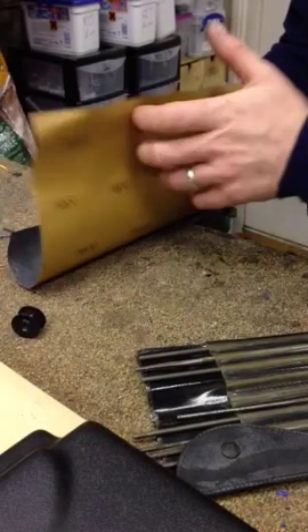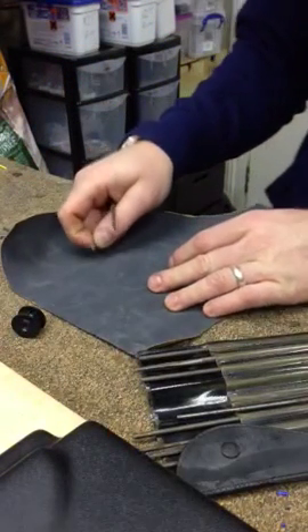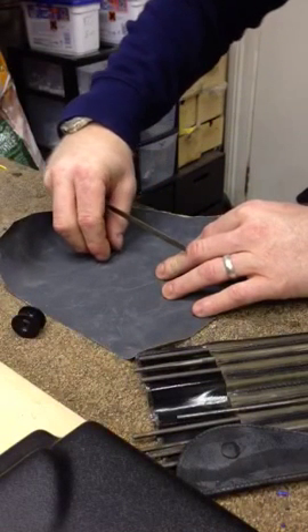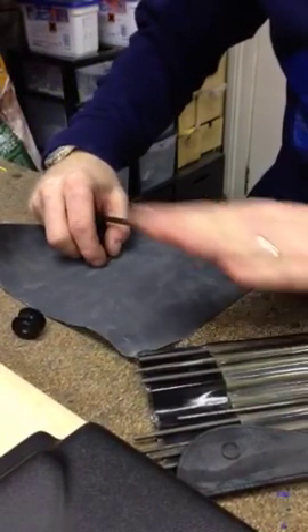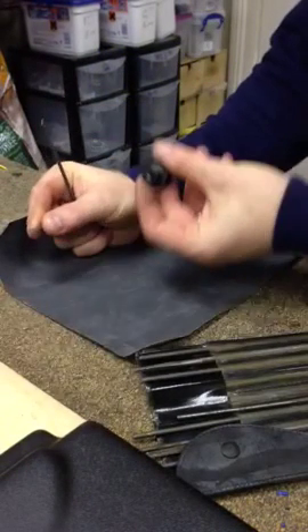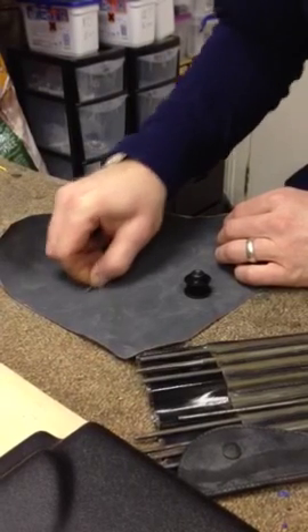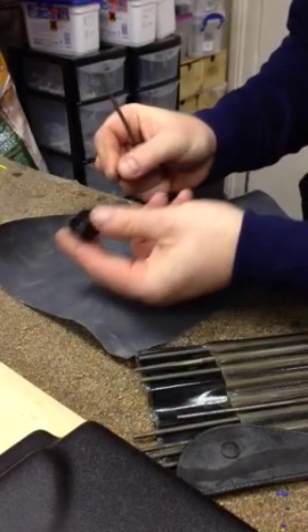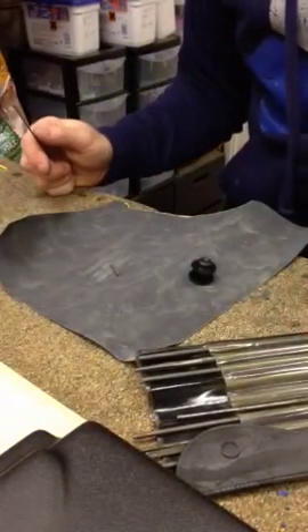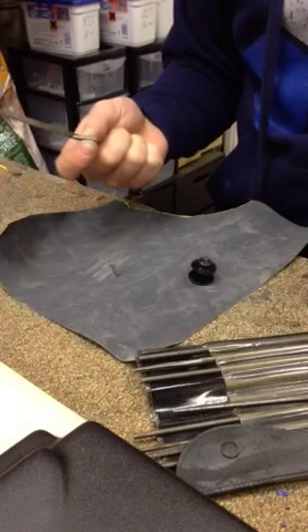You want something like between 600 and 800 grit — this is probably about 4p a sheet, you can buy 10 sheets for a pound or something. Just get your keyway and rub it flat on a flat bench with the paper flat on the table. Put it back in your motor, try it. If it doesn't fit, rub it a bit more, then put it in your motor shaft and try the pulley on. I'm talking a very small amount here — this is all you can do. It's called fitting, final fitting. I can't sell one that fits everything; it's a kit designed to fit all different types of motors.